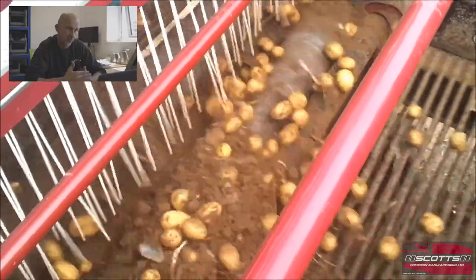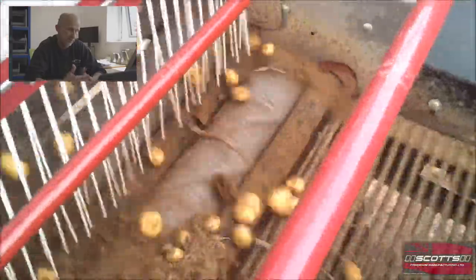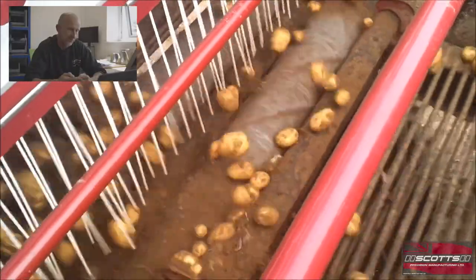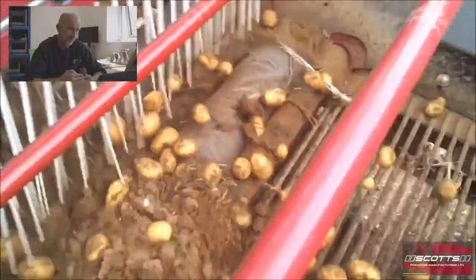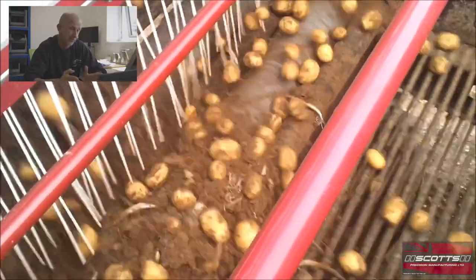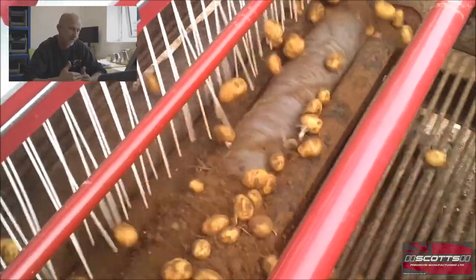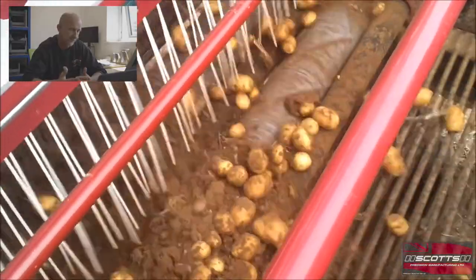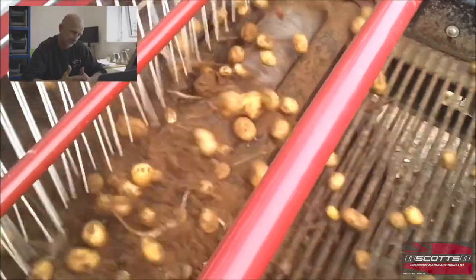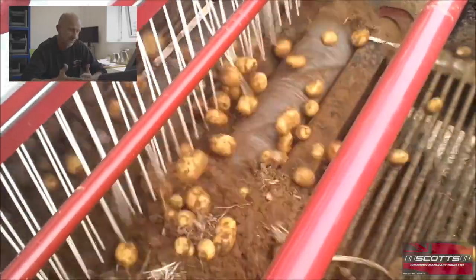We're running the spiral rollers at the preferred 130 rpm — those are the gray rollers running in the same direction as the crop. The clod roller, the black rubber roller visible in the video, is running in the opposite direction, which is the most aggressive way of running it. If we ran the rollers all in the same direction we'd have very little haulm extraction, but because we're running in reverse it's able to grab the haulm and extract it. In most cases on this video we're not getting every bit of soil or every bit of haulm out — the center of the machine is slightly overwhelmed by the amount of loose soil — but where it's been sieved better, we are seeing good cleaning occurring.